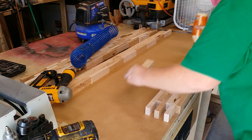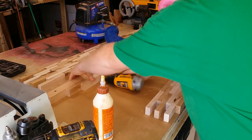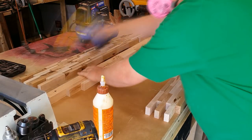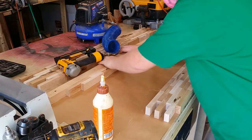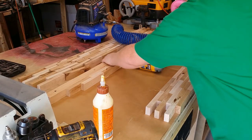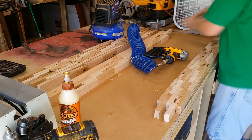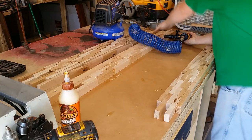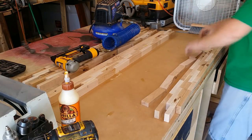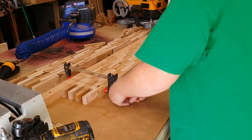I definitely didn't know about it here. What I did is I was trying to go eight runs of these segments strung all at one time, and the failure really is two things: the glue sets faster than I realized, and also clamps don't provide that much pressure. So by the time I get to clamping, the glue is setting and I'm adding four brads on each piece — it's just not smushing in as much as I would like.